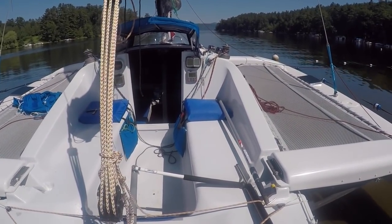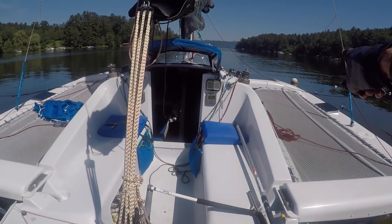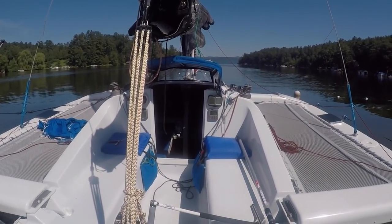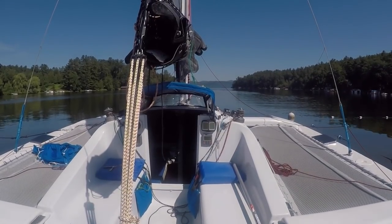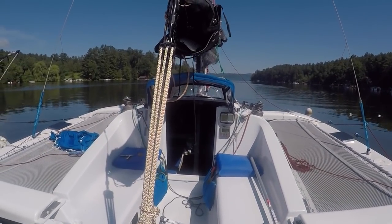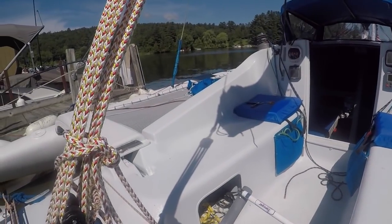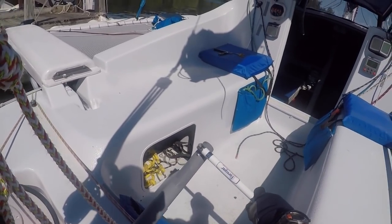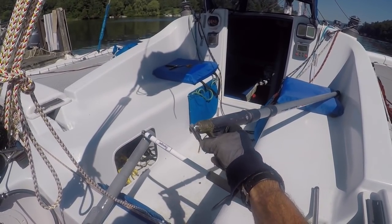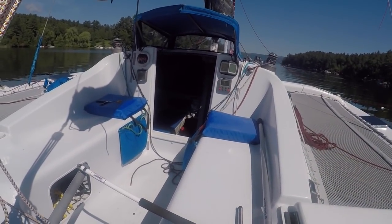One of my questions to the list recently was how to get a super long tiller. What I want to do is optimally be sailing from the front cross beam upwind, and also I can get to the float locker for my anchor in an emergency situation. There were a lot of recommendations about the normal cat style, but those are eight feet, maybe even ten at best, whereas I wanted twelve, and someone recommended the bow hook. So what I did was blend that with what Nelson Wright taught me from his boat. I love the Forespar connectors — there's just no slop to them whatsoever. So on the front of my bow hook I drilled, ordered one of these from Forespar, and then carboned it in. So in any event, I can drive from the forward beam.